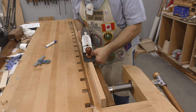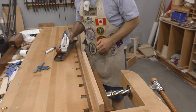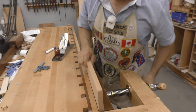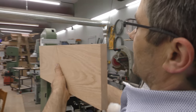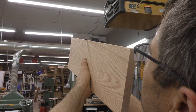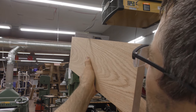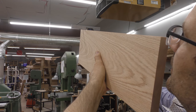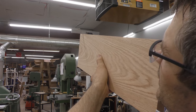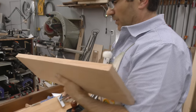Hopefully our blade is parallel to the sole so we're not throwing things out of whack. Now let's check it. Square is tight — lay it against the reference face, hold it up to the light, drop that down. That looks right on — I don't see any light there at all. I'll check this end as well. That looks good, and I'll check this end too. That looks nice and square. So that was an easy one.